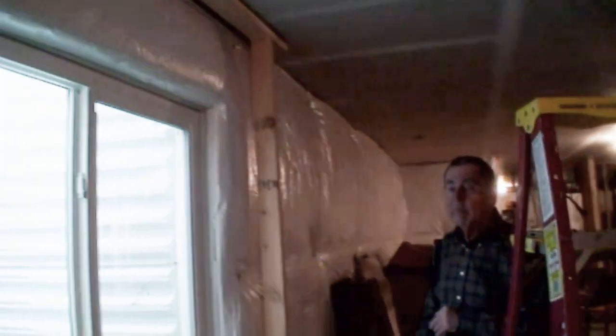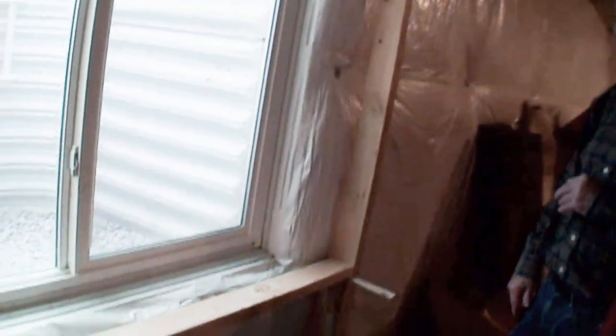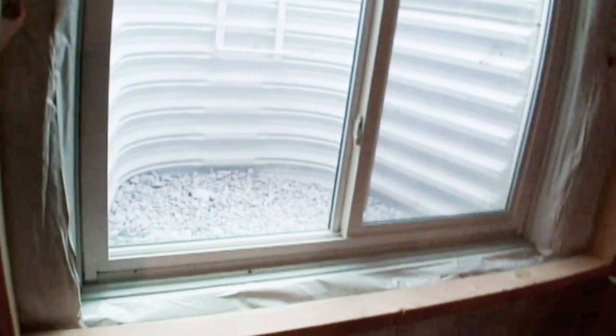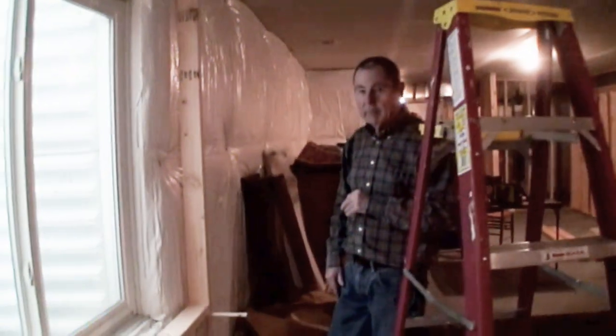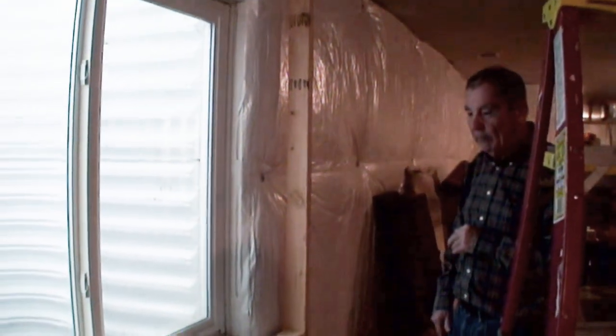For me, the interesting thing today, same as with the fireplace enclosure, was that Tom put an outline frame in place, stood it up against the wall, and now he's making his measurements not from some theoretical position, but from the actual position of where the wood is lying, and putting his lines on the board. Then he came in with the idea of shimming to put that thing at an angle, doing this as it flows, one step at a time in the actual installation. That's a great approach, and you get exactly the result you want. It becomes a custom installation that perfectly fits and perfectly works. No arithmetic errors. It could have been possible to lay this all out, build it off to the side, then carry it in and line it up, and invariably somebody would say, that didn't quite line up exactly as I thought. Good enough. And that's not Tom. Tom builds it the way he does because it comes out exact, which to Tom is the only thing that is good enough.